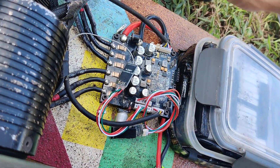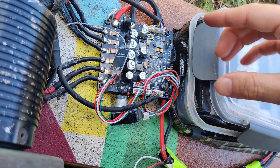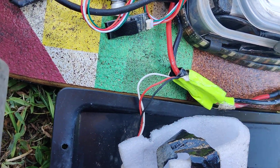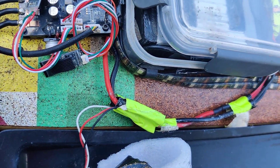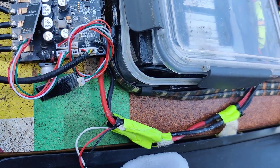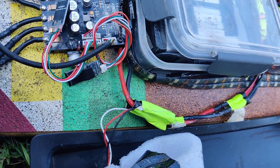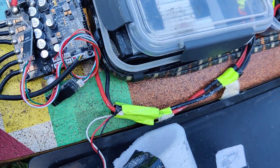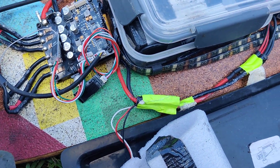It's all China made, which can make shipping times a little lengthy, but they have quality products. I don't know anybody in America making these kinds of chips. I've also put in this inline solid state anti-spark switch. This is a really great feature — I highly recommend it. If you're running a system anything over 12 volts, just plugging and unplugging the battery is going to cause it to spark. I have a kind of a primitive on/off switch here. Some of you out there who have a whole charging rig and setup where you can just plug it in and charge it probably don't need an anti-spark switch as badly. I've got an accessory thing so I can run anything off 5 volts from one of the battery packs in here.